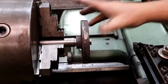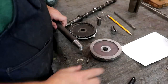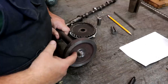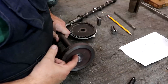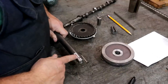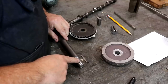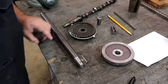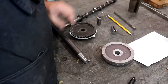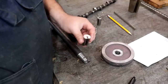We're in great shape there. I've got the taper cut on here. What I did was slide my gear up on it and just took a Sharpie and marked right where the back end is touching, so I have a clear indication on that taper — the smallest diameter that's actually coming into contact with the gear. Now we make our broach bushing. This is a commercially-made broach bushing; we need to put a slot in it.